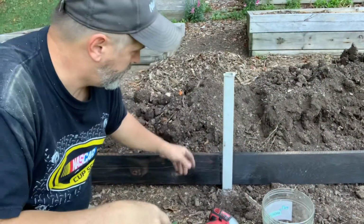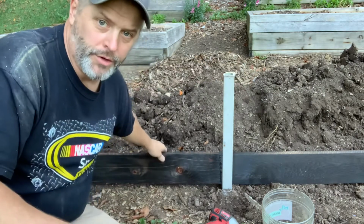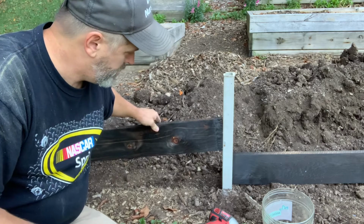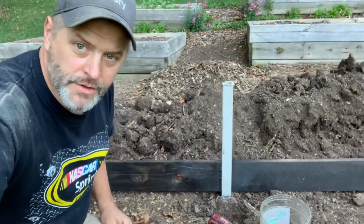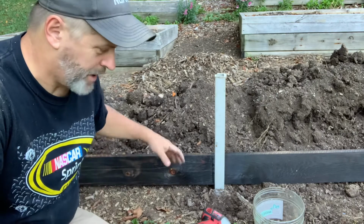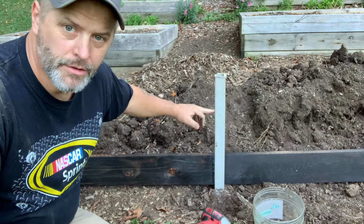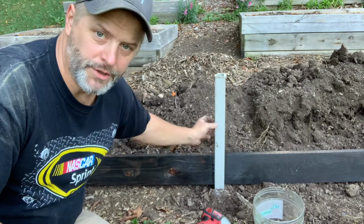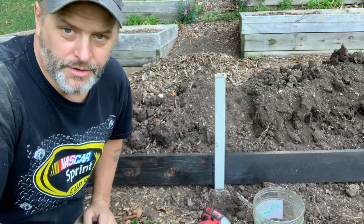Okay, so I moved it over to here so I can see what I'm doing. I'm just gonna pick this board here up, probably somewhere in that area, to screw it fast. This side's way lower than the other side is. I'm not gonna level it out, but I wanna get it up as high as I can, so I'll put the top of the board up to about here. From here down, I'll put insulation boards in between each of these. So that's what I got in mind.